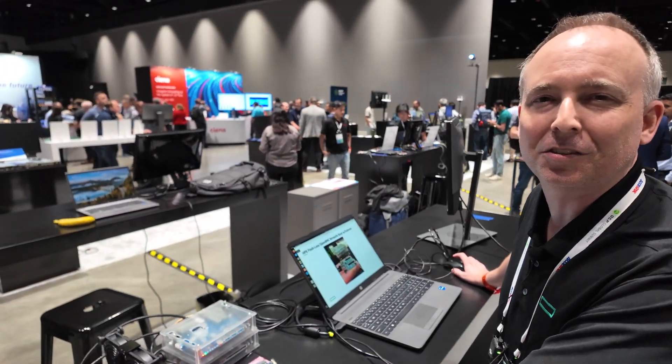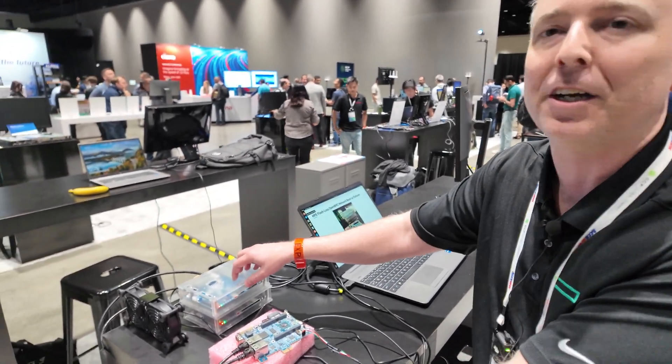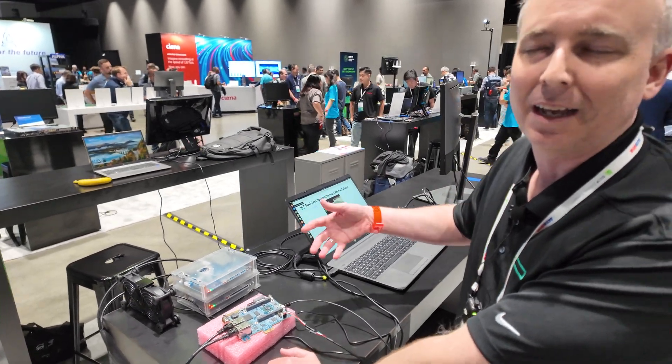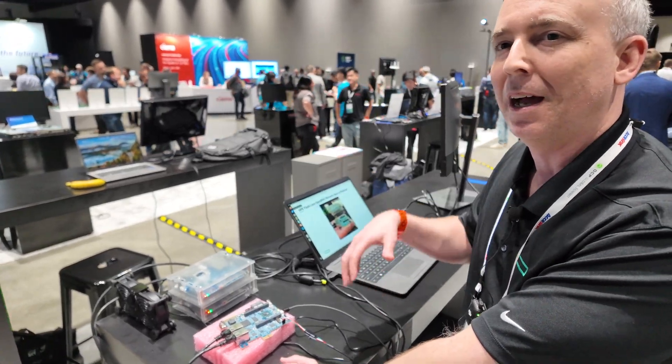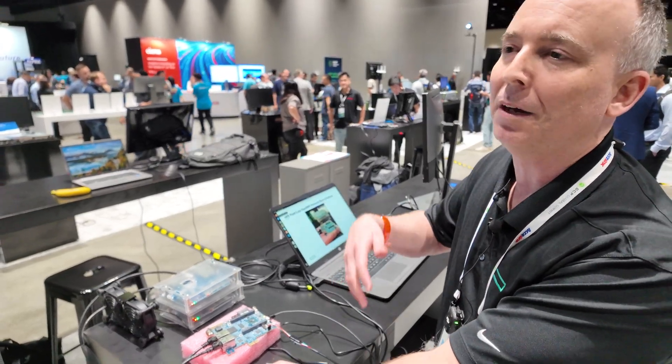It also allows you to start thinking of firmware as more of an OS. In this setup we have a package manager. So if there is a need for a security fix on your BMC, I don't necessarily flash the system — I can go to the BMC, install an updated package, reboot, and I'm updated.